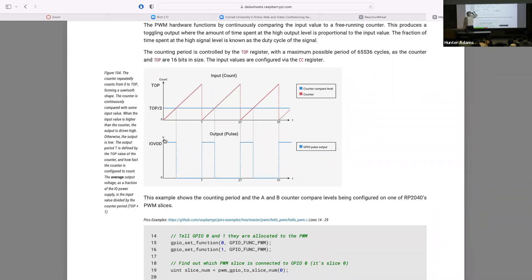The canonical PWM channel is composed of a counter that counts up to some threshold — you configure that threshold, which sets the period of the PWM signal. It's in a register called 'top'. Once the counter counts up to that number, it resets to zero and counts up again. It constantly compares the counter value to a separate register called the counter compare level. When the counter is less than this threshold, the PWM output is high; when greater, the output is low. By playing with the compare threshold, we vary the duty cycle.